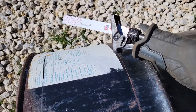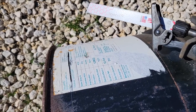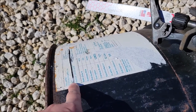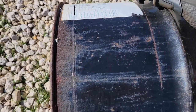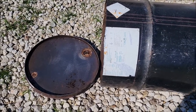I made a long initial cut with the long blade, then slid the blade into that slice and walked around the barrel to cut it smooth. The lid is off — it's not perfect but it's close enough to the line. Also, ear protection is something you want to think about; cutting a metal barrel is actually pretty loud.